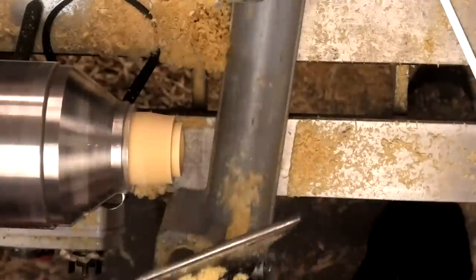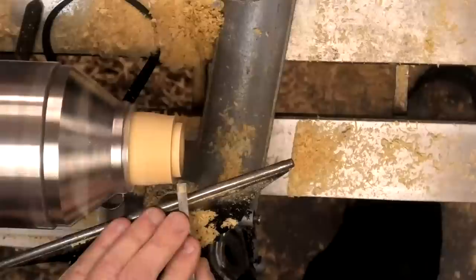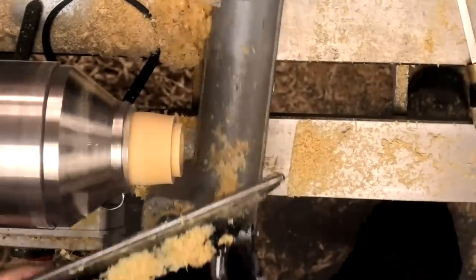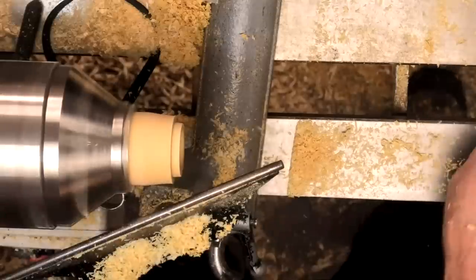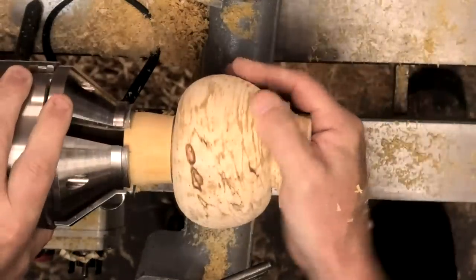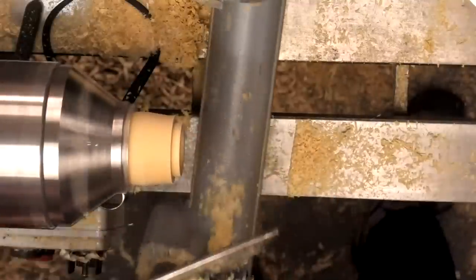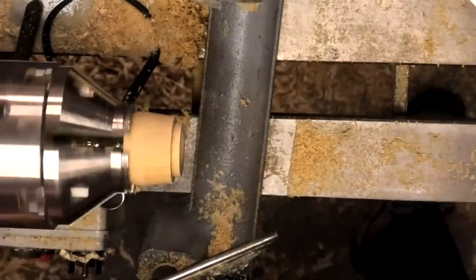Don't try and get it bang on immediately. Taper the cut a bit more, because once the front of the taper fits in, you then have a dimension to cut to. Almost, almost. We're going in. We're in all the way. Good. Nice little fit there.